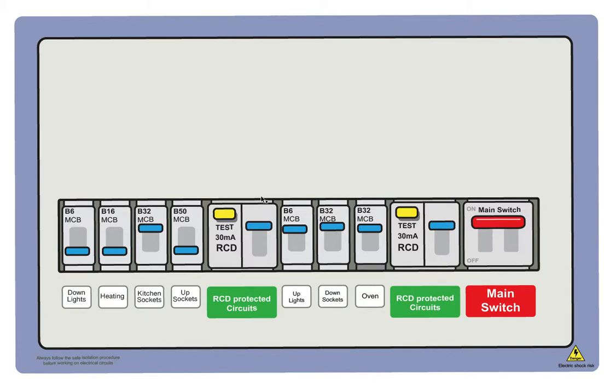the RCD. It might be the case that you just can't find it. RCDs are very sensitive, and it might not be an appliance, it might be something in the infrastructure of the building. If that's the case, you're going to have to call an electrician who can do some more thorough testing. But this is just a way of finding out if it's something simple, a device, your coffee machine. If it's your fridge, hopefully nothing like a washing machine or something starts getting expensive if that's a fault. So that's a good way of just testing.